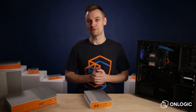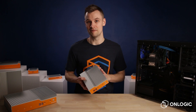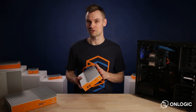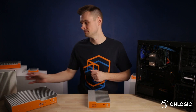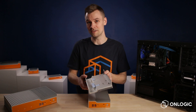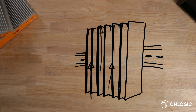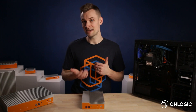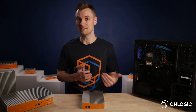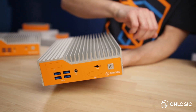We just described how a fanless PC works — well, sort of. The outside of this chassis is the heatsink, or heatsinks, we were just talking about, and all the parts you'd expect to find in a big boxy computer are also in here, though they're going to be a little more durable and heat resistant than their counterparts. There's a whole little mountain range of surfaces machined on the inside that matches up with the various parts on the motherboard and in the computer. Hot air rises, so as the heatsink heats up, it creates a flow of air upwards past the thin surfaces, removing heat. That's why we advise people to install these vertically — larger area for air movement and heating of the air to happen, and thus increased airflow. And that's what drives cooling of the outside surfaces and the removal of all that heat from the computer.